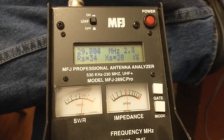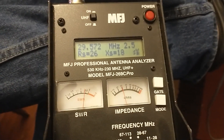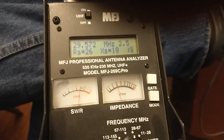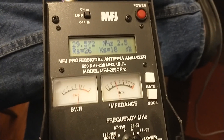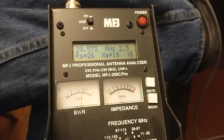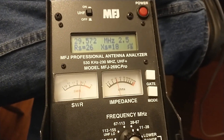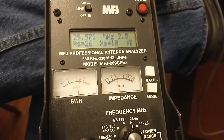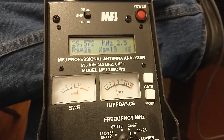It's well within range of anything. My IC-7300 could tune by itself, and my IT-100 tuner would be able to handle up to 10-to-1, I believe. Which isn't quite the best, but it'll work. The other bands are pretty acceptable though — except 80 meters, that wire's a little short for that. But let's throw it on the radio and see what it sounds like.